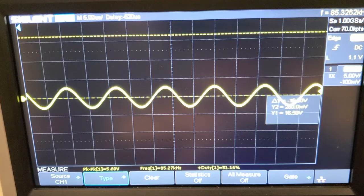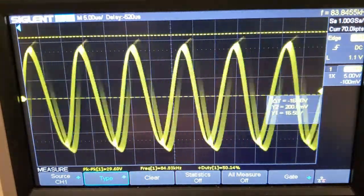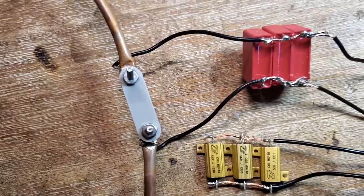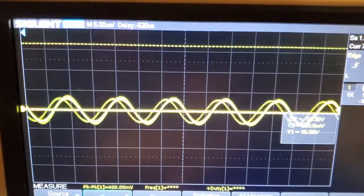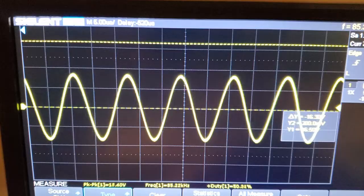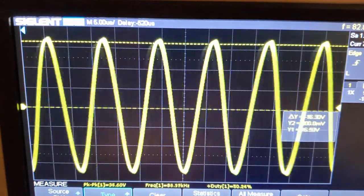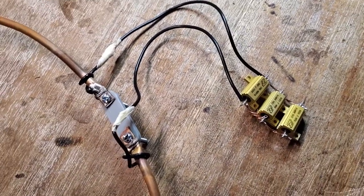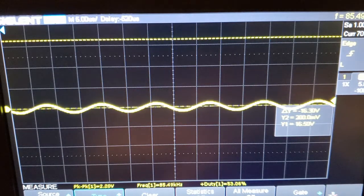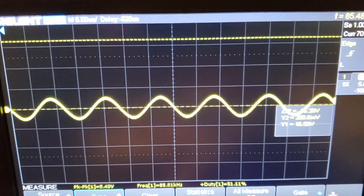Let's look at the output on the scope again. My peak-to-peak voltage was about 20 volts before, but with the resonant capacitors in the circuit, it now goes well over 50. But this is an open circuit measurement. Let's see how well it holds up when I put a load on it. I added an 18.7-ohm dummy load to the receiver and measured it on the scope again. The peak-to-peak voltage maxed out at about 41, and I could actually feel the resistors getting warm. But how does that compare with a non-resonant circuit? Here's the receiver output with the resonant capacitors removed. The maximum peak-to-peak is 8.6 volts compared to 41 volts previously — that's almost a 5-fold drop in voltage and a 25-fold power reduction.